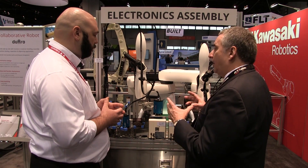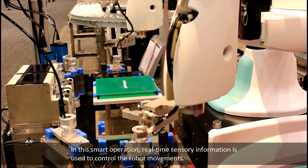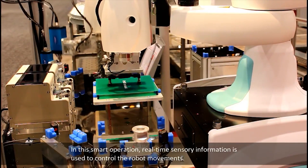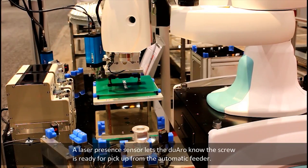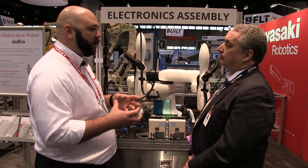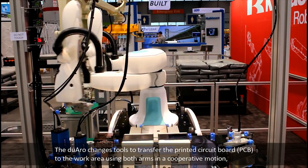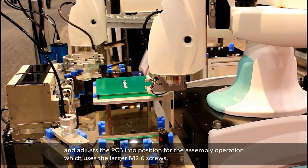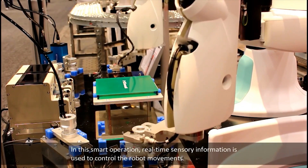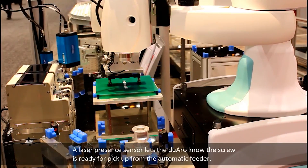In the past, automation for fine assembly was very expensive — sophisticated fixturing was necessary, and alignment was essentially engineered into the hardware. In this case, the fixturing is not particularly expensive or complex. The idea is to break everything down to its lowest common denominator, using crowding-type fixturing to crowd corners into place. One unique thing is you can operate this as two separate robots doing two tasks at the same time, or bring both arms together to manipulate one piece cooperatively.